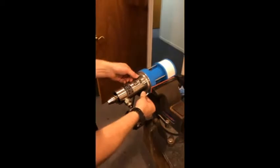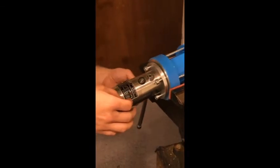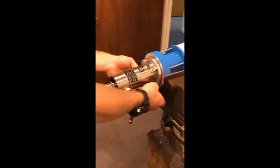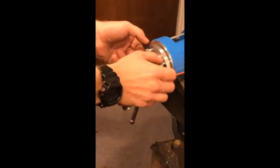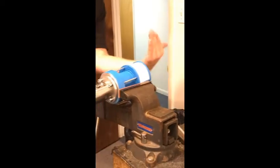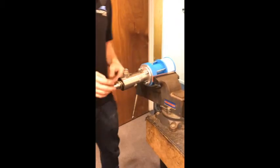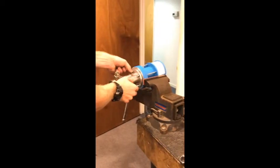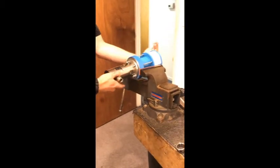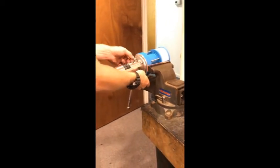We're going to replace our four bolts on the top. When tightening them, do a cross pattern like a four-lug tire. Also take into consideration your particular machine — on a 150, the air end comes in from the back and your water comes out here, so pivot it to the proper position. The 650 is the other way around — the air comes in the back and it's rotated, hitting 90s and going backwards. Take that into consideration.